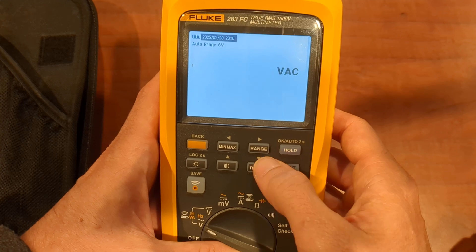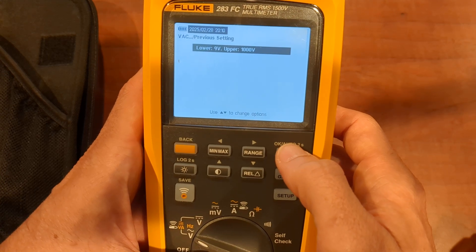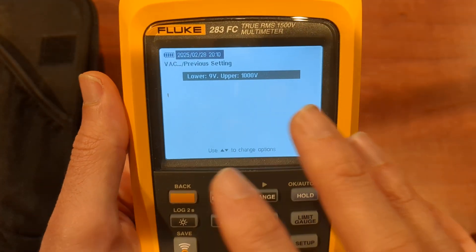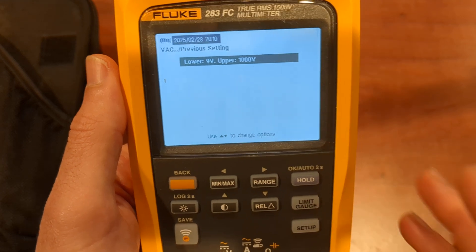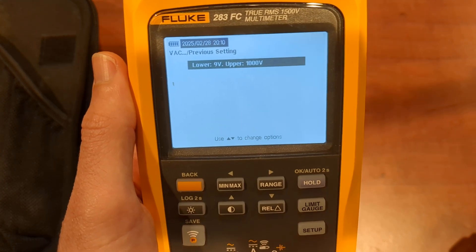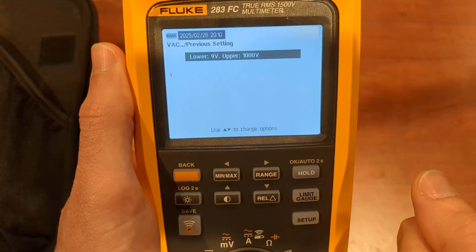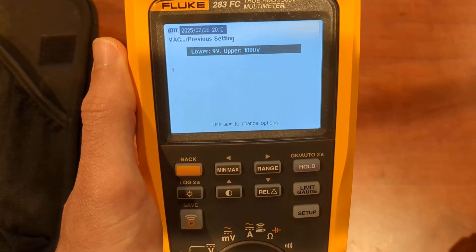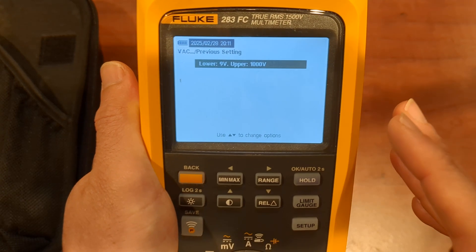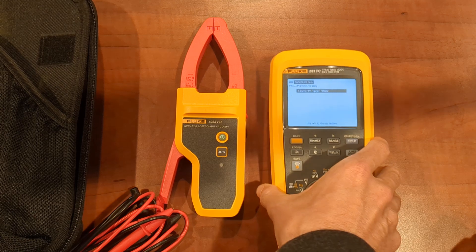Let me turn that back off — disable. Going into previous settings, I can show you I put a lower limit as less than 9 volts. As an example of where you could use this for safety: let's say you're in an industrial place and you have a multi-craft maintenance crew, or people that are only supposed to be dealing with low voltage like less than 24 volts. They could have this set for 26 or 28 volts, and if they hook on to 120, it'll start flashing them and they know they shouldn't be messing with that circuit. Obviously they could disengage it, but it would make it somewhat idiot-proof — if you've hooked up to something above the voltage you're rated to work on, you get a big flashing red warning sign. That's a cool application in the industrial world.